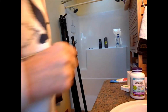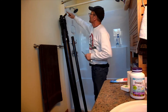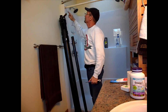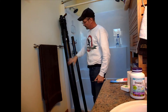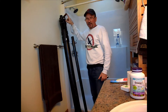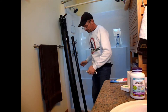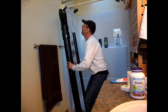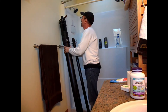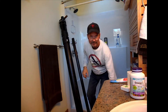This is my shower hot water heat recovery system. Cold water from the city supply goes in here, through this heat exchanger, and then comes out here into the hot water tank. Hot shower water comes in here, fills up this container, comes around through the loop at the bottom — there's the loop on the bottom — and drains out here back into the sewer system.